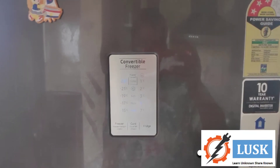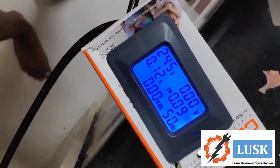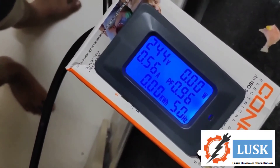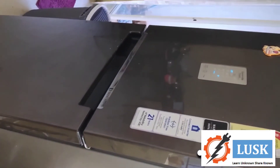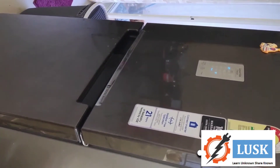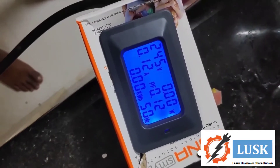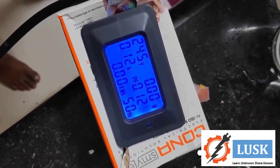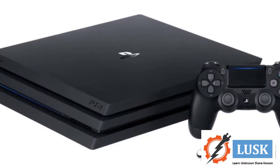Next, the inductive load — the fridge. The fridge is an inductive load because it has a motor. It is an inverter fridge, so I switched it off for some time and then switched it on. Initially the power factor was around 0.8 to 0.9 because the compressor was running. After some time, as cooling settled, the compressor motor started slowing down — being an inverter motor — and the power factor also started reducing to around 0.1 to 0.2, and the amperage also became very low at around 0.12. Frequency and voltage are okay. As I said, watts and kilowatt-hour are not working.